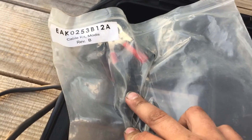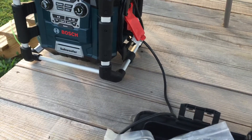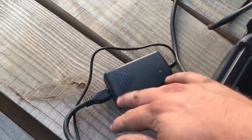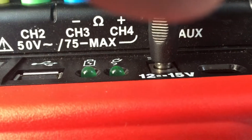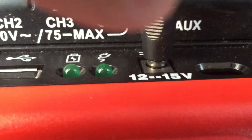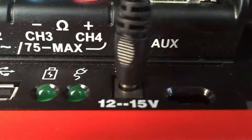It also comes with keys for different cars. This is your 12-volt hookup and it has the AC plug. Right now I've got it hooked up to my radio, just like a laptop hooks up. But you can hook it up to the batteries — it can only do 12-volt, specifically 12 to 15 volts. So whenever you're running a car and it's pushing out 14 volts to charge the battery, that's the range you're going to want. And it is fused.